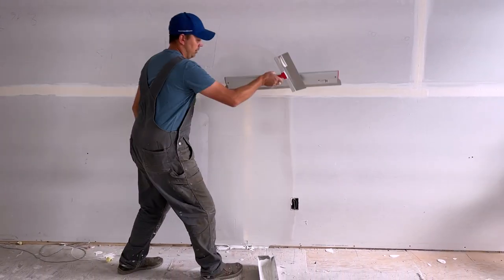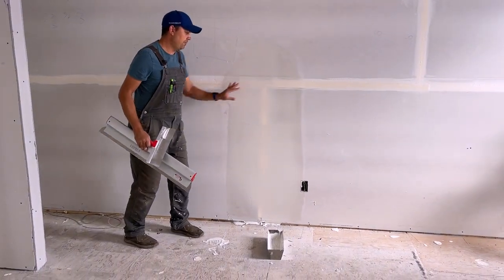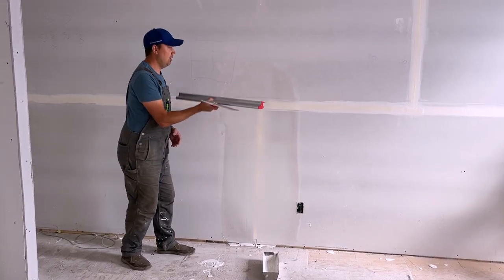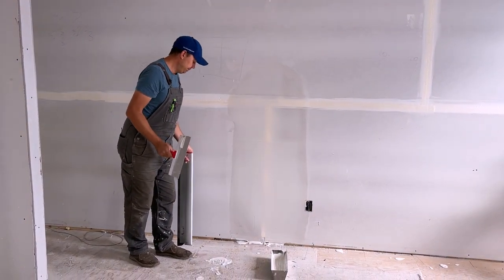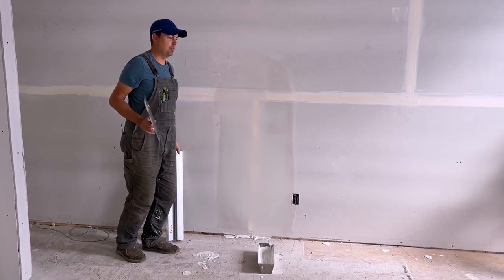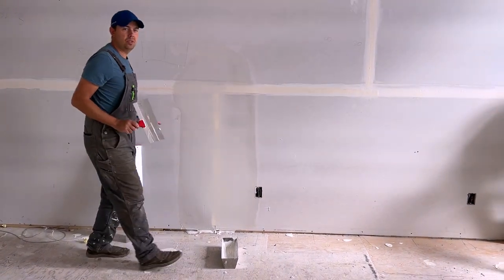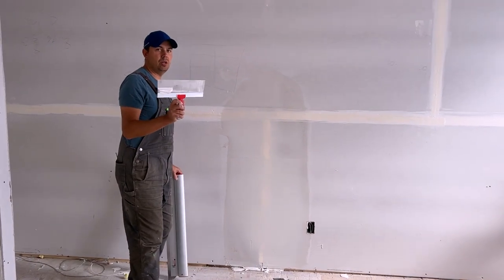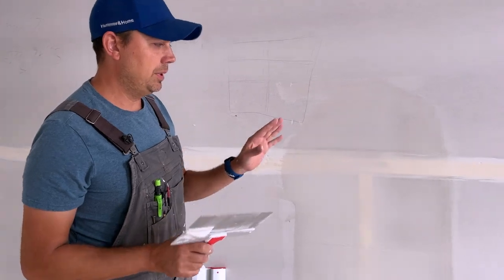If it's really bad you can go even larger and come out 32 or 24 inches on either side, so you're really feathering this out. You're going to want to feel it when you're done with your hand — feel if there's any bumps. Take your trowel, put it on the wall, see if you've got any big divots or holes. And then when you prime it, that's when you know if you've screwed up or if you've done a good job. With the tapered joints these are a lot easier — you don't need a 32-inch trowel for that. You can get away with just a 12-inch, or if you're finding it a little bit hard, let me show you.